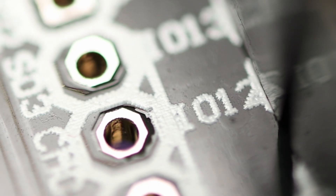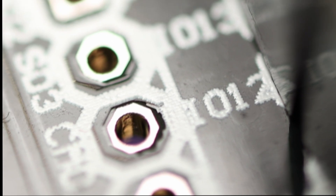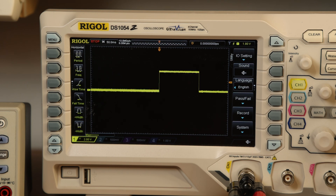After digging into the pinout and boot behavior of the ESP for a couple of hours, I found the culprit: GPIO 12. During boot, this pin tells the controller which voltage the internal flash is set to. If it is driven high, the ESP expects 1.8 volts, but the controller operates at 3.3 volts — therefore the flash was not recognized during boot. A quick measurement with my oscilloscope confirmed a 3.3-volt burst at this pin during boot.